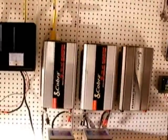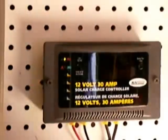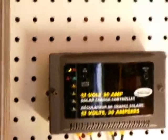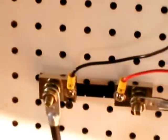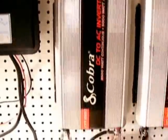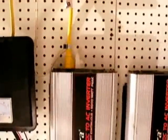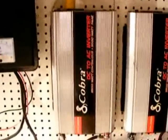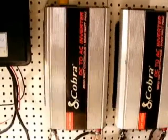These are the inverters that we're feeding. I've got the input from the solar coming through a cheap 30 amp solar charger picked up from Fry's. The 500 watt wind generator is coming in here. I've got an amp meter mounted on a very simple box coming through the shunt, which then goes to the batteries. This is the primary inverter — the one the wife knows about. She comes out and flips the switch when the power goes out or she wants to use alternate power. All she has to do is turn this inverter on and go over to the poor man's transfer switch, which I'll show you later.